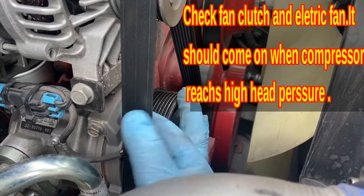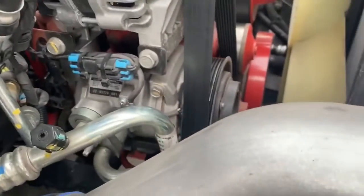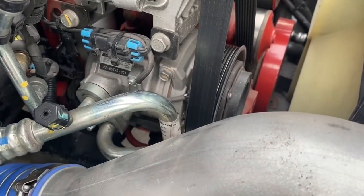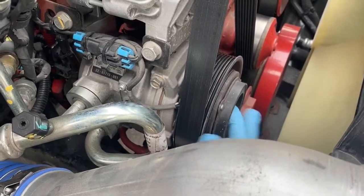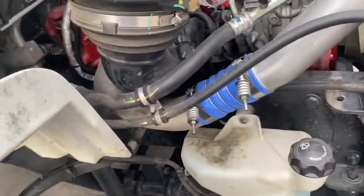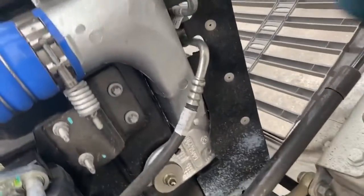You're also checking the belts too — make sure everything's good. Check for any dry belts, and you'll see if there are any unusual loose belts; that can make a big difference. If you want to look for any signs of a leak, you'll see like a buildup of wetness around it, and that can be a sign of a leak. A lot of times, most of your leaks come from the front of these compressors. That's very common — it's like a seal in the front here behind this thing. Now we're just checking around the lines; you want to look for any kind of leaks, just any visual. You're just taking it once over, checking your hoses around, and go around to your condenser up front.